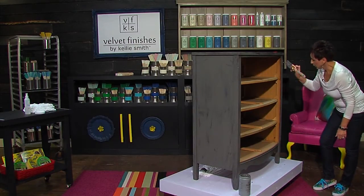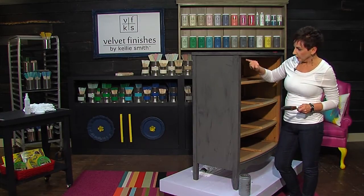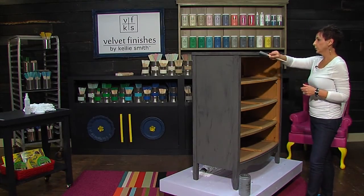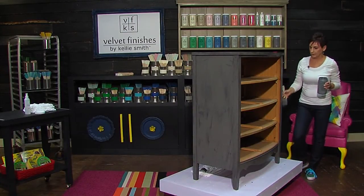Now if you wanted to distress or glaze your piece — we have glazes and gels, and the gels replace wax in the Velvet Finishes line — this piece has a perfect place to do that because of this great architectural detail. If you know you're going to glaze, you really don't have to have a perfect paint job, because different depths and layers get glazed over. And if you're going to distress it, it's almost better not to. Sometimes it's really nice to let the natural wood show on the outside and only paint the drawers, or vice versa.